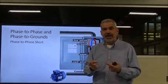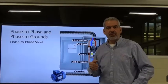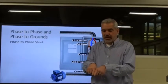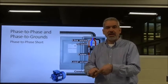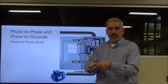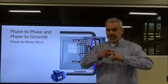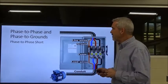In the real world, how it happens is that there is always vibration around equipment and machinery, particularly in production. You'll wind up with conductors laying on one another, particularly in a piece of conduit, and they will rub until the insulation is rubbed bare on both of the conductors. Then all you've got is bare copper conductors touching each other, and that's where your short occurs. If we didn't have short circuit protection, things would start to glow red hot, catch a lot of things on fire and damage a lot of things.